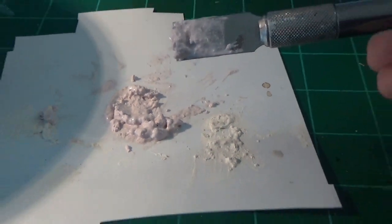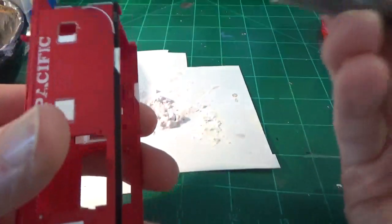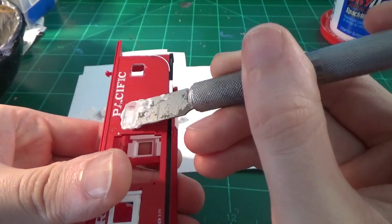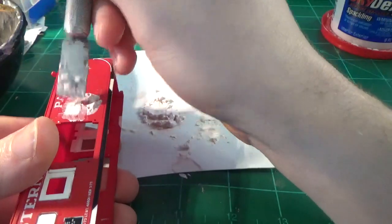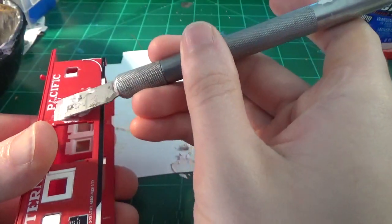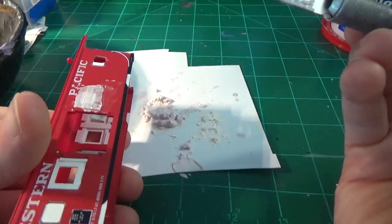Now what we're going to do is use this material to fill in the gaps in the windows — for example this one here, this one in the corner. I'll demonstrate the easy ones first. Essentially you just take a little bit of putty, guide it over the seam, and fill in all the cracks. I'm being sloppy at first, but as I get the putty guided into the spot I'll make a heavier pass over it and then kind of clean up the edge a little bit.